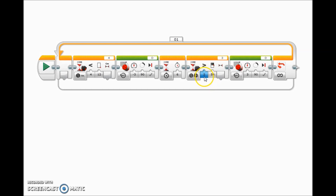Here's what's going on with the infrared. I have it set for greater than — I believe that would be 54 centimeters, though I'm not sure what the unit of measure is for that one. When it sees over 54, it's going to activate the gate to go up — the opposite of the first sensor. And then like I said, it's looped, so it just keeps going round and round. The neat part is that when the train is going by, it does not see over 54, but once that last car goes by, it should read over 54 and activate the gate to come up. And that's the program.